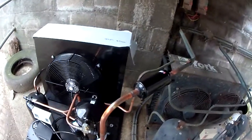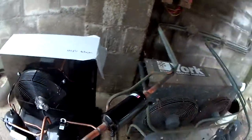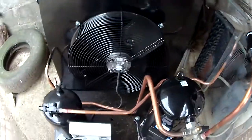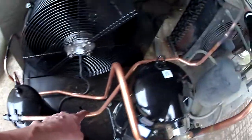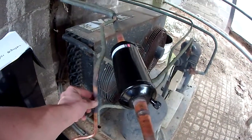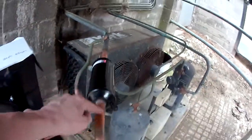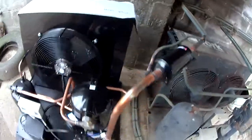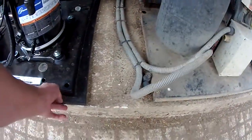We've got that piped in and put a burnout dryer on. We've got a liquid line dryer on the other end of the system. So we've got our pipework — we've got the receiver round the compressor and then we've joined it onto the existing. We've got a couple of bends in there to get round the dryer and that's luckily lined up. We've got some rubber blocks to keep the vibration down.